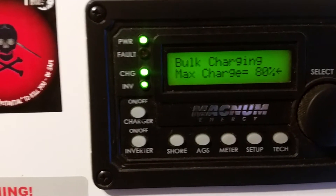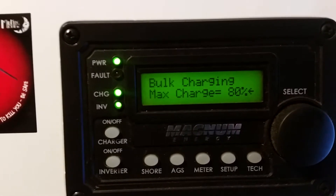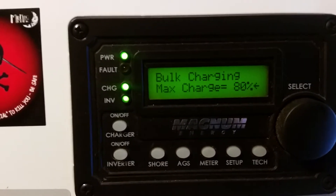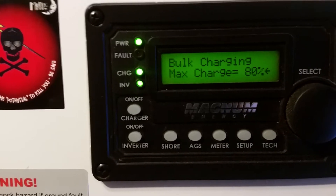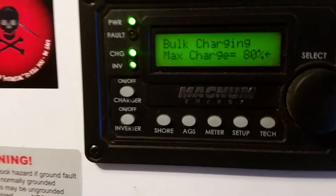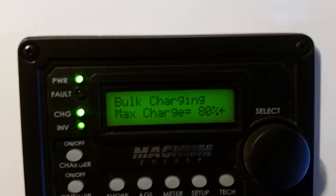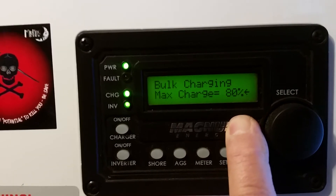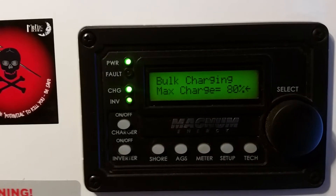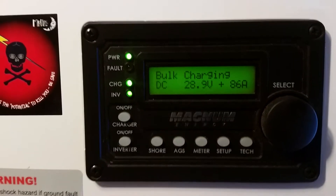The reason I do this is because I have a military generator that's rated at 3,000 watts, but it'll handle over 4,000 all day long. Because it's rated at 3,000 watts, I leave the charge rate at 80%. Taking the voltage curve and the amps it's putting into the batteries at 80%, it turns out to about 2,000 watts, and that leaves me 1,000 watts to run the house.